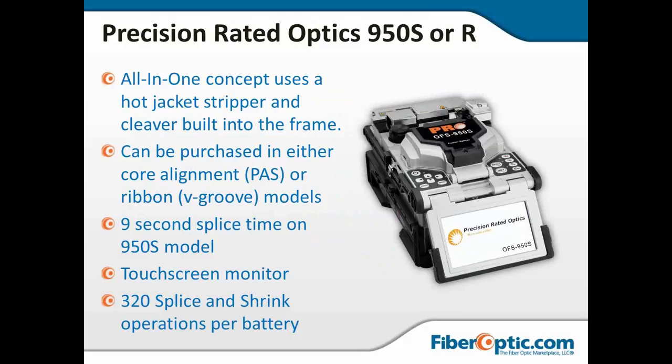Now, I mentioned earlier the all-in-one unit that is a whole lot easier to work in tight environments. This is the Precision Rated Optics 950S, and it does also come in a ribbon or R version. It looks identical, to be totally honest with you. If it wasn't for the labeling, you wouldn't be able to tell the S from the R until you open the screen or open the lid. The all-in-one concept has your hot jacket stripper in the back, the cleaver and the alcohol dispenser are just behind the windscreen, and everything is in one place. Rather than having a stripper, an alcohol bottle, and a cleaver